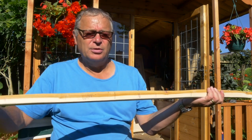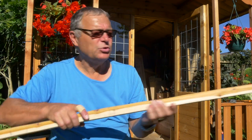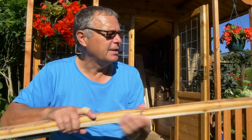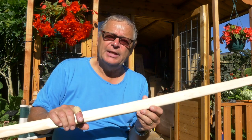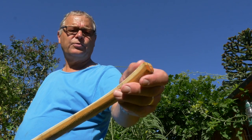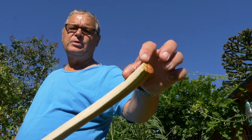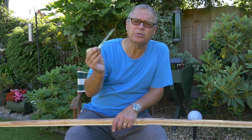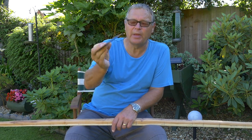So today I'm going to start taking the belly down a little bit, just evening out the taper, checking the dimensions all the way along the bow from tip to centre and centre out to tip again, with the aim of trying to get this bow on the tiller. Whilst I'm doing that, I shall flatten the tips at each end of the bow so I can fit a piece of wood on each end to act as a temporary nock. I'm going to use a cabinet scraper now — just a flat piece of metal with a burr on the edge.